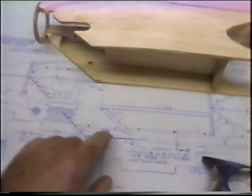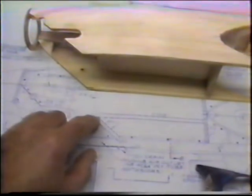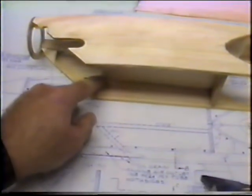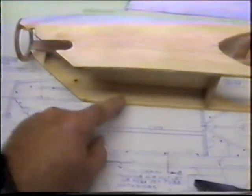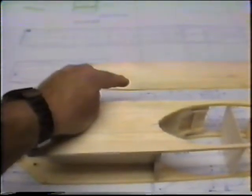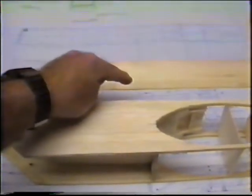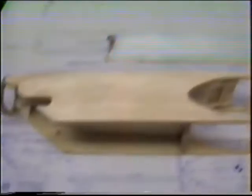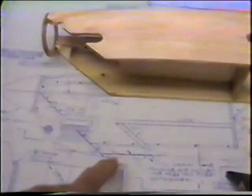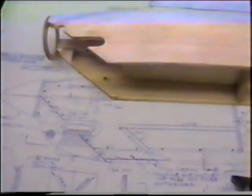These were rolled 64th balsa tubes, but I want to start by getting this former in, and I'll reference off the back of the tank box, same angle, and then I need to interpolate and get that same former up into here in balsa wood before I start grinding away my holes for the tubes. This works so well, I don't plan to reinvent anything here.